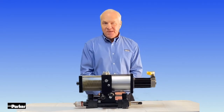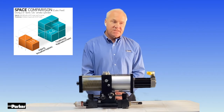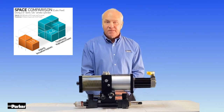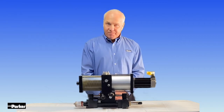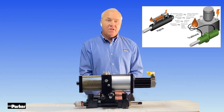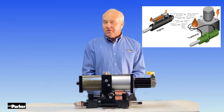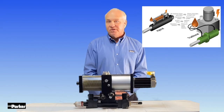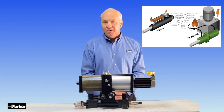Another feature of the HAAS unit is the space claim. A typical hydraulic system to generate this type of force would consume about 6.6 cubic feet of machine space, whereas this HAAS 500 unit is reduced to just under 2 cubic feet — a 3.5x reduction of space claim on your machine. The unit operates on power on demand, meaning the system only consumes energy while doing motion. We use typical hydraulic load-holding mechanisms to lock the unit in place. It is valveless control — to control the actuator, we control how fast we spin the pump, and to control direction, we control which rotation we're spinning the pump. This gives us proportional control without the heat-generating, energy-consuming proportional valves.